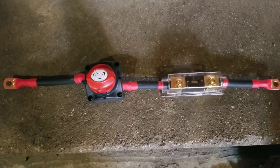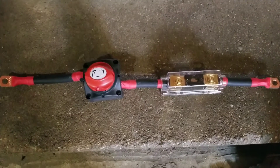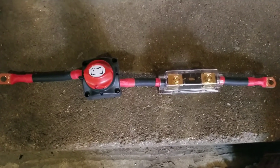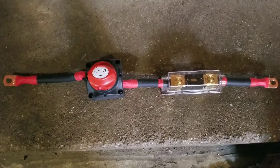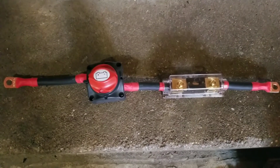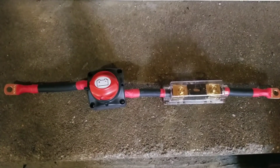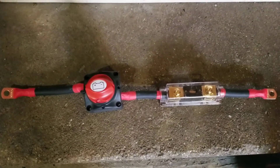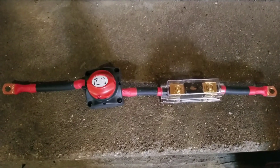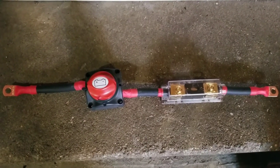This is a low-cost alternative to buying expensive pre-made units. Here's what it all costs if you put it together: 2 AWG cable, the lugs, the disconnect, the 250 amp fuse, the 400 amp fuse block, plus your labor and time. I'm teaching you how to do this simple stuff for your DIY project so instead of spending a lot of money, you can build it the way you want and keep your system safe and ready for all the loads you'll be pulling.